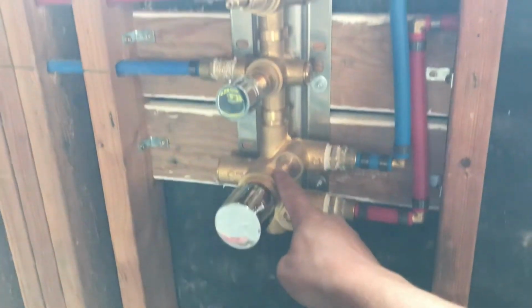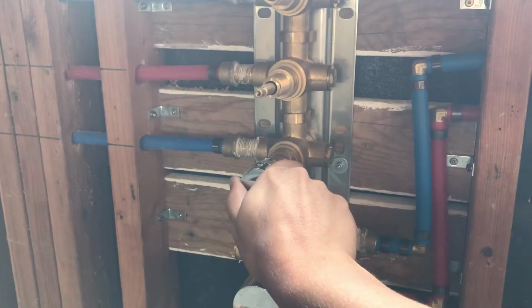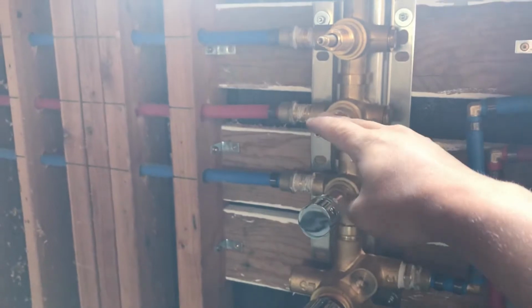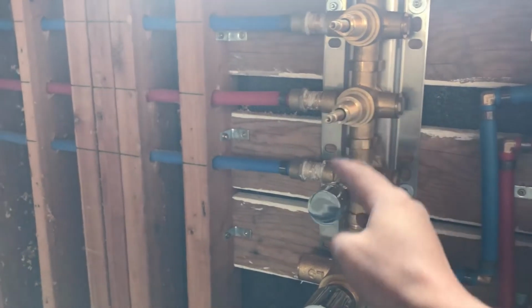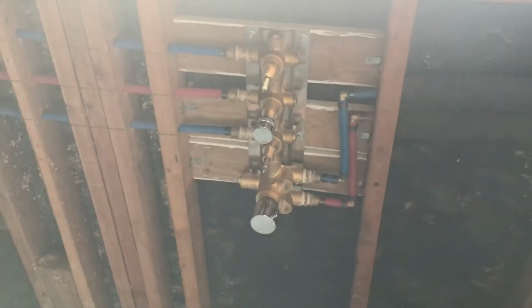And then the water goes up to these. These are on and off valves that are just 1/4 turn. And you just turn it a little bit if you want to reduce the pressure, turn it all the way if you want to increase the pressure. So you can turn all of them on, all of them off, 2 on, 2 off. It doesn't matter because they're all individual turn-on valves. It's very simple, very straightforward, and really very easy to install once you have the adapters.